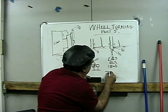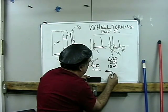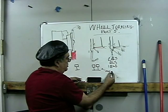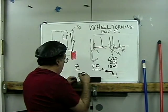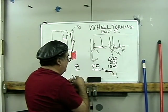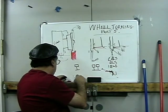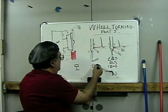This is the rail head's radius. Now if you have a bigger radius it's going to cause all the work to be done on this poor small portion out here. This small portion out here is where it's going to ride, right in here, and it's going to keep this area away from the rail — there's going to be a gap — and you're going to ride on this radius right in this area. That's what actually makes less friction for pulling.